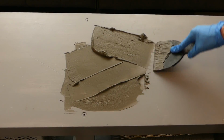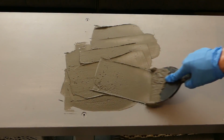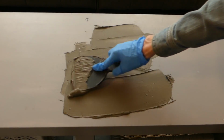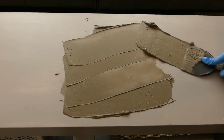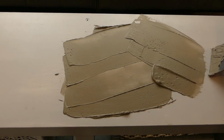Apply the feather finish to your surface in a thin layer the same way you'd ice a cake. Smooth out harsh lines or divots as you go. It doesn't have to be perfect either. Concrete is organically modern, so a little texture gives it character. Continue until you have your entire surface and side edges covered with a first layer and allowed to dry.